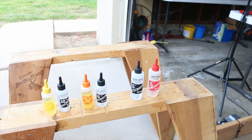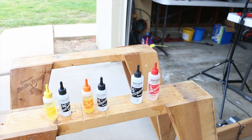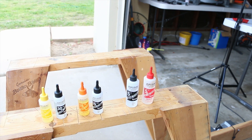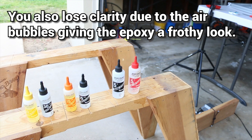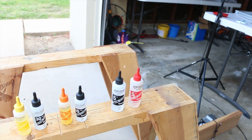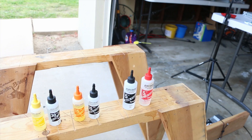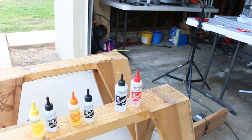The issue with these is not necessarily that the components themselves are cheap — it is how you get the two components together. You squirt them onto a flat surface, then use something to stir them, and you're whipping in air bubbles. Those air bubbles actually make it weaker, so your bonds have little microscopic pockets of air. Between the air bubbles, the inconsistencies in mixing ratios, and inadequate mixing — sometimes epoxy won't quite cure because you didn't mix it well enough — this is just not good stuff.